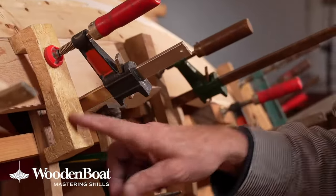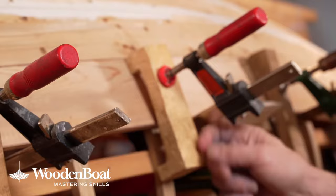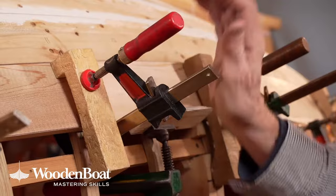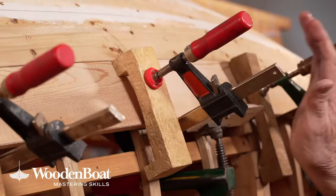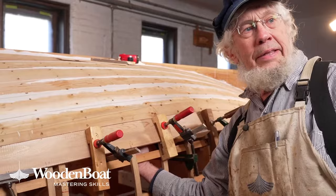What this does: you have one part of the hollow of your block hitting the frame here, and the other part hits right here. There's a gap underneath here, so this picks up a ribband that's underneath. You clamp this down — this is already contacting here, so that can't go anywhere. So as you tighten this up, this guy is gonna roll in. And you gotta roll it in until it gets tight. Then put your hand in underneath and you want to feel that it is indeed flush on the inside.